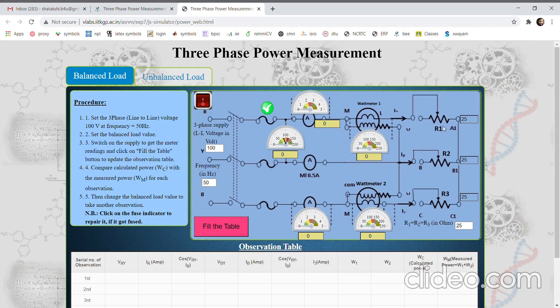In this case we are going to get the same readings in the two wattmeters. If we have a power factor other than unity, then we will have different readings in both the wattmeters. Since it is a balanced load, all these values will change simultaneously through this control, so let us fix the value of resistance.